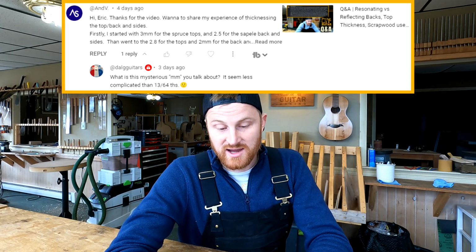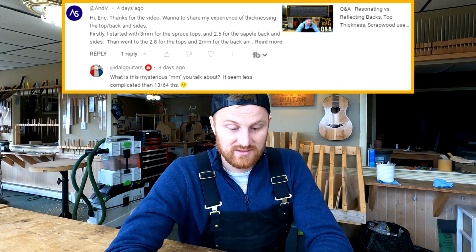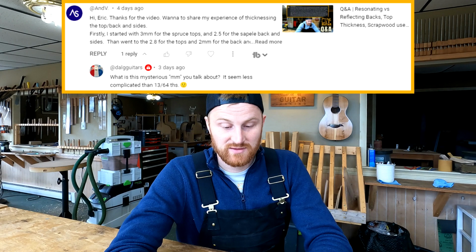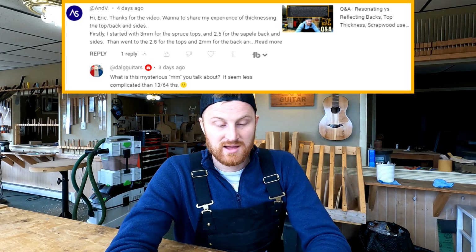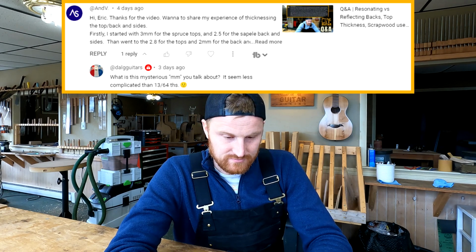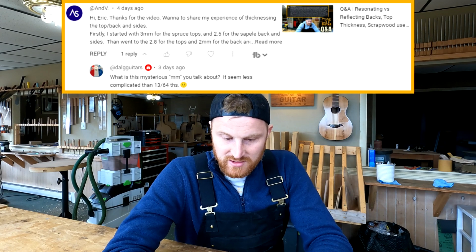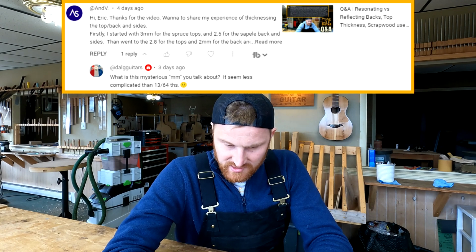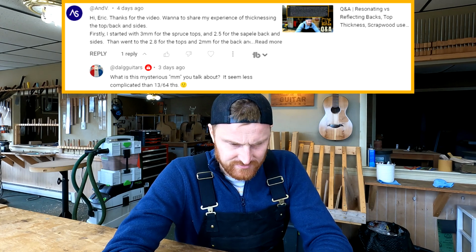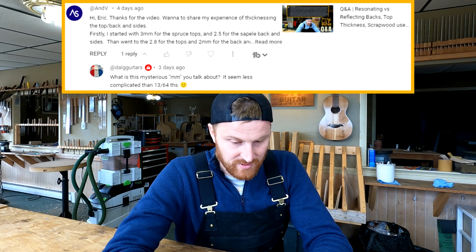And V writes, hi Eric, thanks for the video. I want to share my experience of thicknessing the top and back and sides. So in the last Q&A video, we were talking about what thickness we use for tops and for backs. And V writes, firstly, I started with 3 millimeters for the spruce tops and 2.5 for the sapelli back and sides. Then went to 2.8 for the tops and 2 millimeters for the back and sides. Still using spruce for the tops and maple or sapelli for the back and sides.